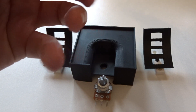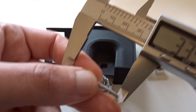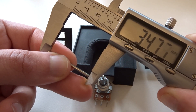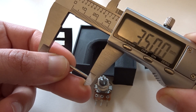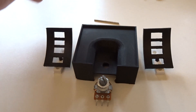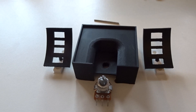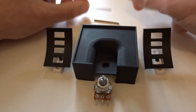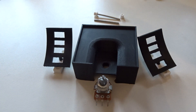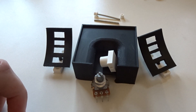What I basically need is a base, two bars that can hold the rudder pedals and have two evenly sized holes in them, a potentiometer, two iron crossbars with a diameter of 2.5 millimeters and a width of around 35 millimeters, and some connection parts to connect everything together. Since this project isn't going to be tough on any microcontroller, you can use an Arduino Uno, Mega, whatever you have laying around.